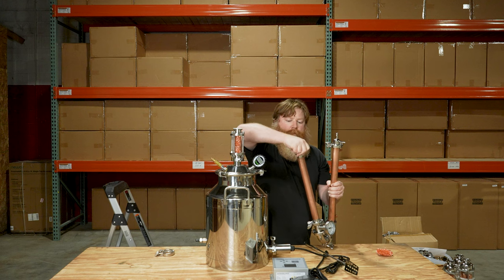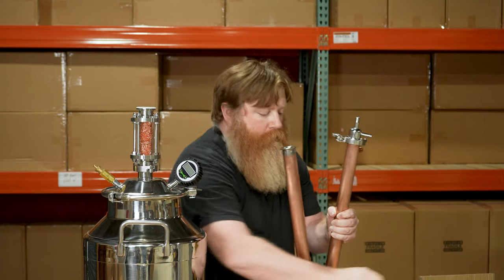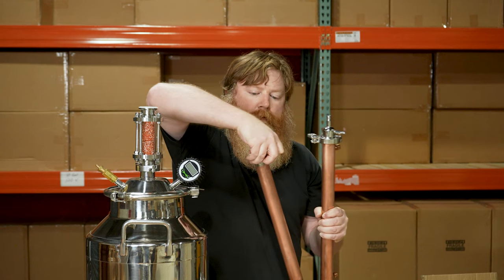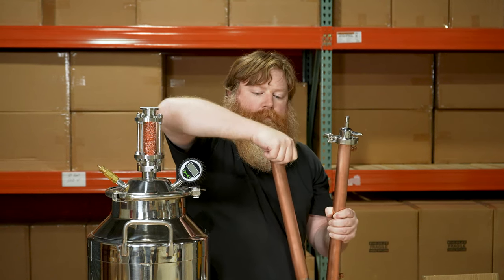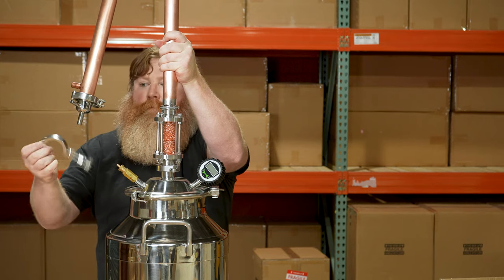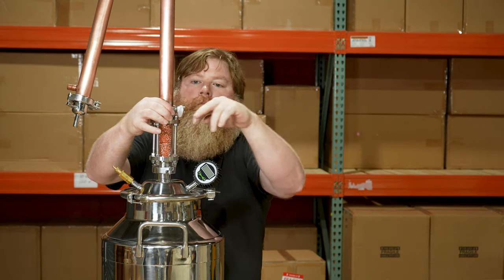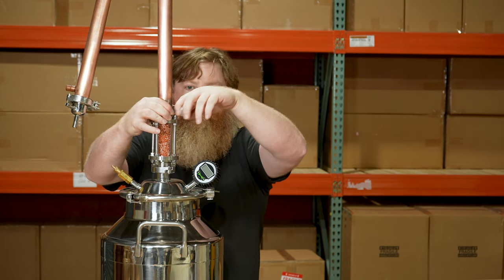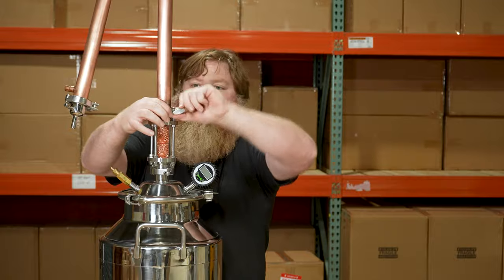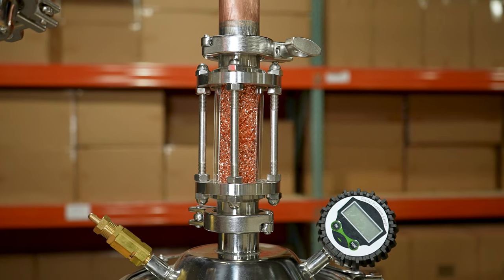Push the packing material into place with something long and narrow such as a mash paddle, but do not tightly pack the copper mesh within the column. Copper has been the standard material used to construct stills for hundreds of years. It's still used today partially because of tradition but also because of the positive effect that copper has on distillate. However, copper is not as durable as stainless steel — it is much more difficult to clean and maintain, and also isn't appropriate for all types of distillation. The entire still doesn't need to be fabricated with copper to realize the benefits, and for this reason we prefer using stainless steel as the base structure for our stills and adding copper where needed depending on what's being distilled.